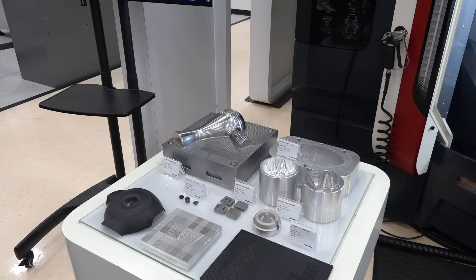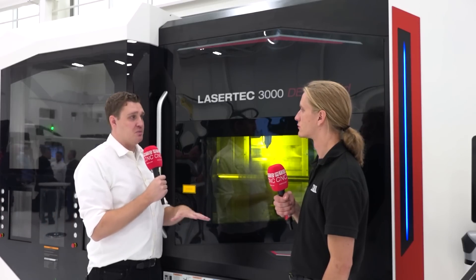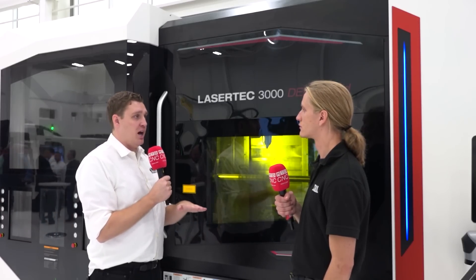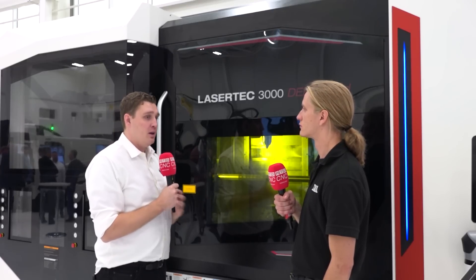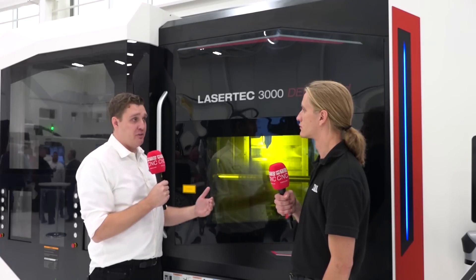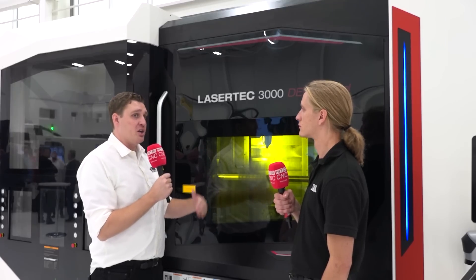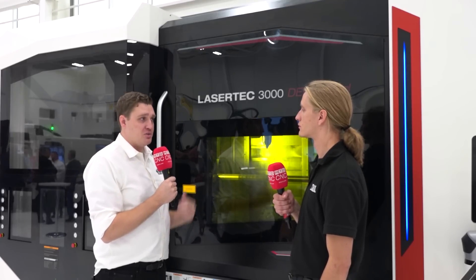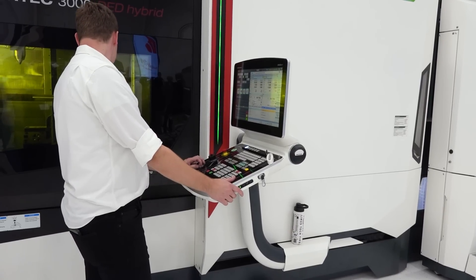So you may change your material properties just depending on the geometry that you print, but we can use that to our advantage. With a single layer coating, having a large subsurface material and then putting a thin coating on top means that you can quench that weld and actually achieve higher hardness than you would normally. One of our favorite applications is using Ferro 55 as a hard-facing material because in that quenching situation we can achieve upper 60s Rockwell hardness with Ferro 55, and we can beat or exceed what is typically H13 in applications.